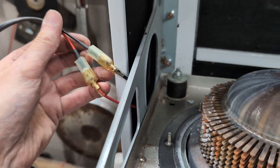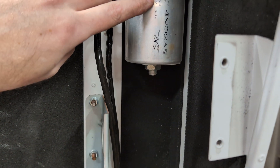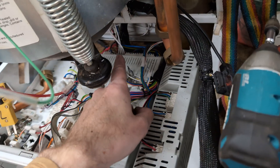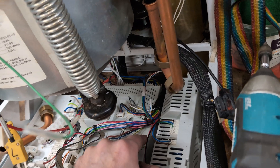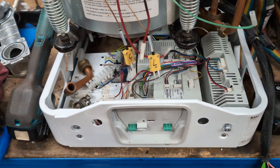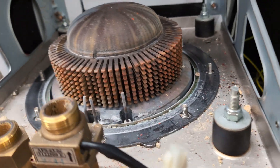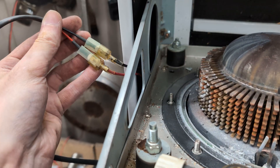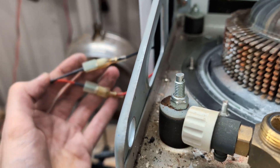There's a positive wire which goes up to a 44 microfarad capacitor up here and then back down into the electronics. But none of those electronics help us because they're looking for things like the gas boiler being on, water pressure, and lots of other variables. What we want is just a hot side, a cold side, this to start moving, and some sort of AC output — which is what we're going to have to test next.